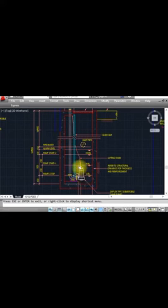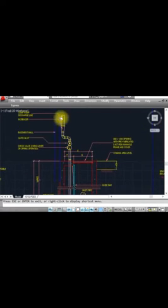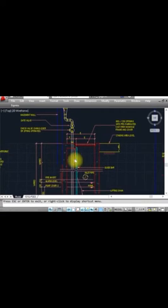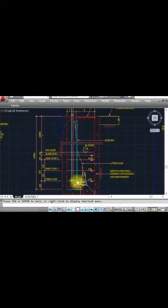Water also comes in from rainwater collection. When the level is high, it will automatically switch on and drain the water. This pipe goes to the discharge line to the manhole. This is basically one rod — we call it a guide bar — and we install it so we can lift the sump pump up and down.